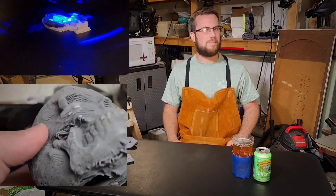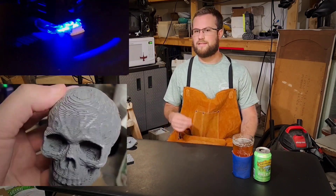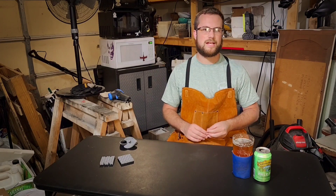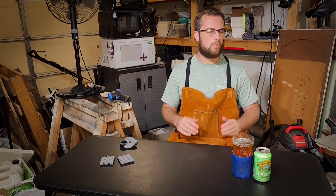Prior to sintering, a green part is printed at normal 3D printing operating temperatures, because the metal powder is bound in a PLA equivalent binder rather than being fused at the time of printing. Once printed, these green parts need to be debound — in other words, have the binder removed while leaving the metal powder behind in the shape of our part. Although there are a few options for metal FFF, I work primarily with the Virtual Foundry's filament. I'll of course be linking their store page below, as well as all of my equipment in the description of this video.